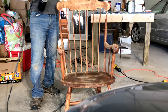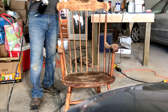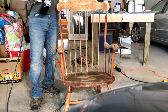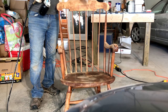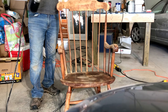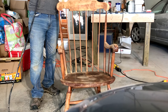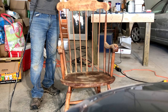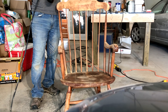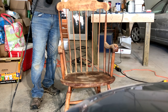The next step is to go ahead and apply our paint. We're going to do thin coats — it'll probably take at least two coats to completely do this chair. I'm going to start from the top, work our way down: start from the top, do the sides, and then all the way down to the bottom. You want to be about four, five, maybe even six inches off the surface of the chair depending on how thick your paint is coming out. Take your time, don't over-spray. It's better to put on thin coats than thick coats and have runs.